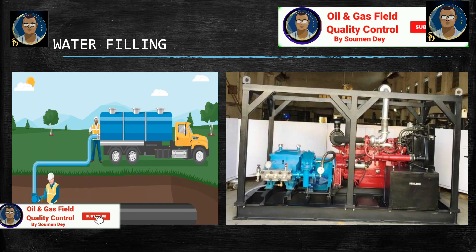The system should be filled by pumping a pig — poly or squeezy — in front of the fluid to help force the air out of the system. In systems containing T's and branches it may not be suitable to use a pig, as the pig may get caught in one of the side branches. Fluid should enter the system at the lowest point and air must be vented from the highest point or points. Allow fluid to flow through the vents until there is no evidence of air coming out from the system. When all air is removed, seal the vents and prepare for testing.